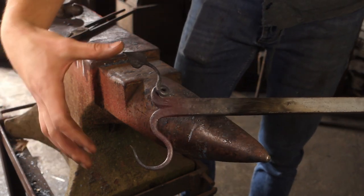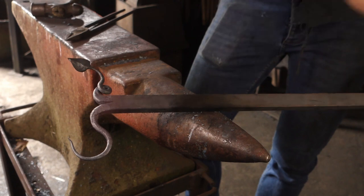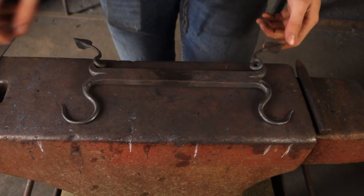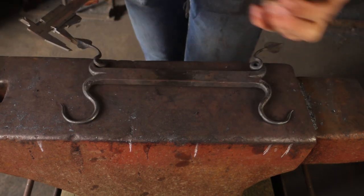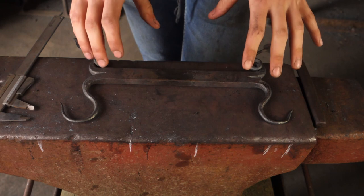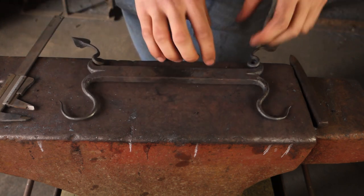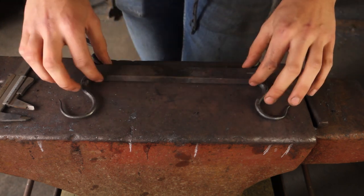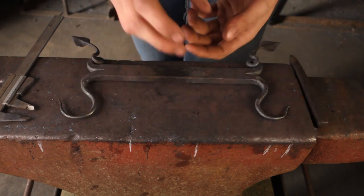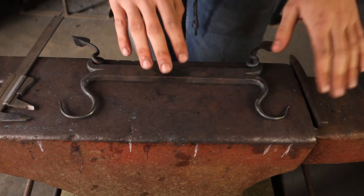What I need to do is obviously do this design on the other end of the back plate. So I'll cut it off and forge all of this out again, but I'll do it off camera because it's all just exactly the same as you've just watched. So the other side is all done. I'm going to scribe some lines on now and then centre punch where we need these holes. I'm going to drill the holes rather than try punching them — if we punch them we might get a little bit of distortion on the edges. I want the edges to be parallel rather than swell out as we get those 6.5mm holes in there.